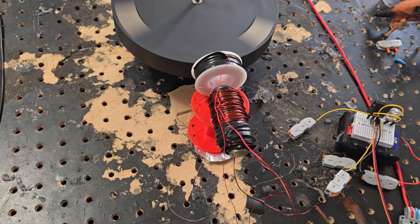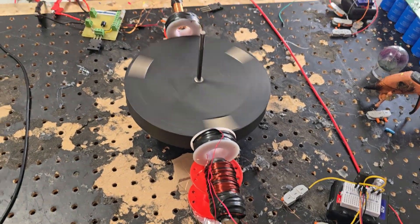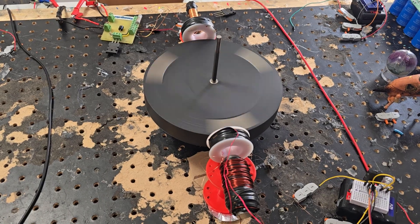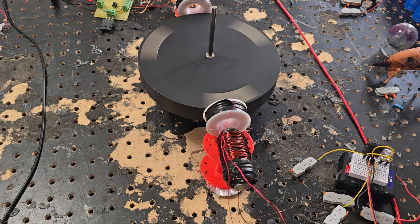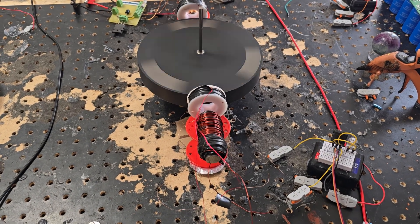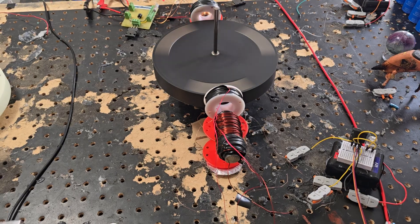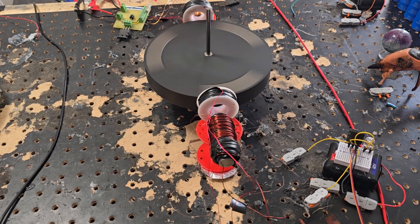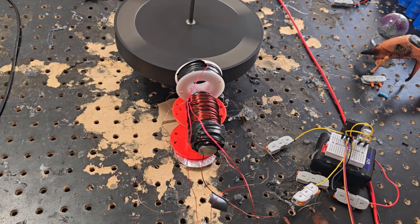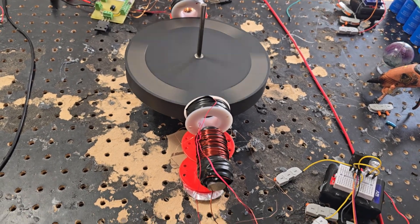It's awesome — it's got a little bit of an acceleration phase, but it is twice as far away as that coil over there, which is two layers of 20-gauge on a half-inch core, three inches in length. Wow, it's moving pretty quick now. That's four layers and I taped each layer so it's pretty uniform — a pretty good wrap done by hand. It is a single-file coil.